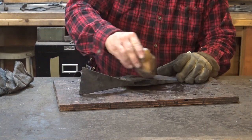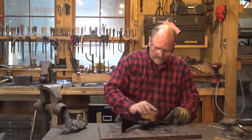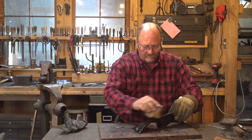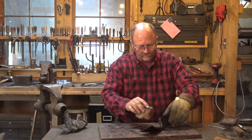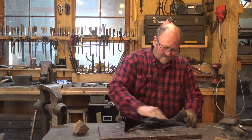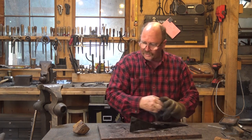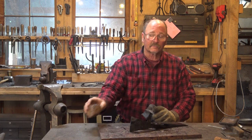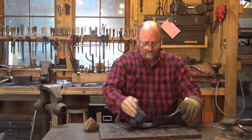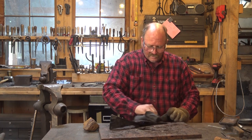It's been an hour in the oven and a little bit of time cooling down, but before it's completely cool I want to put a little beeswax on this. The beeswax helps protect it, helps keep it from rusting if it's out in the field in damp weather, but it also gives it a very nice even black color that I really like. One reason for the beeswax instead of my usual Johnson's paste wax is just because it's so easy to rub this big block of beeswax all over this, rather than trying to paint something this big with a brush.